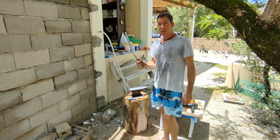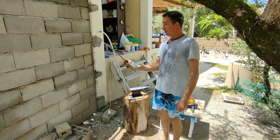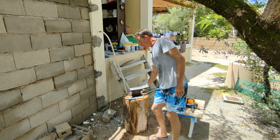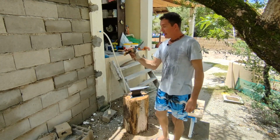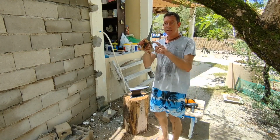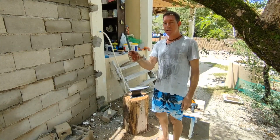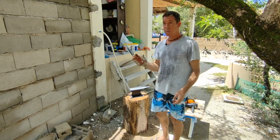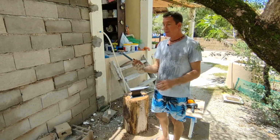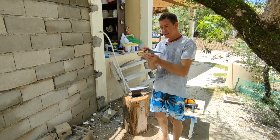Alrighty, so I've got my steel blank cut out from the truck spring. It's a bit wider than the first knife build. If you watched the first knife build, I used that as a template. This knife, because it's going to be a fishing knife, is going to be the same, except it's going to have a slightly larger handguard, just so that when the end user is using it, and he's covered in fish slime, his hand is protected from sliding onto the blade. So everything's going to be the same, except I just got to extend this bit out.